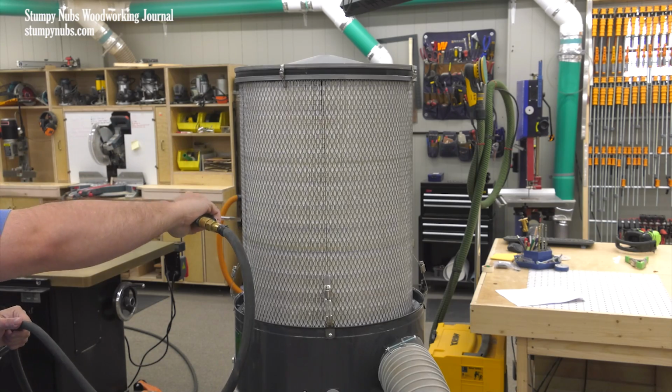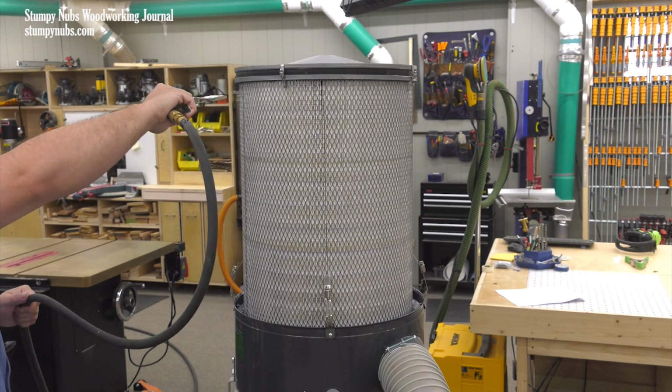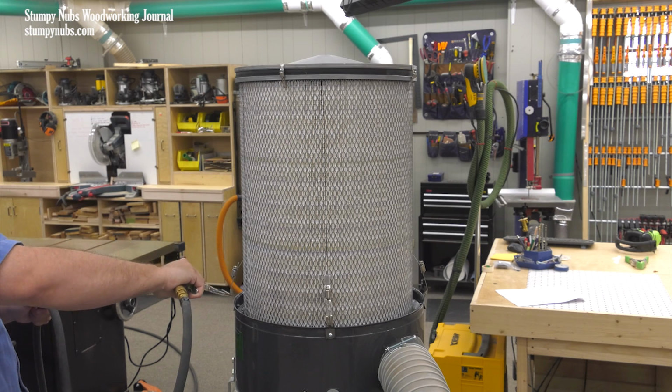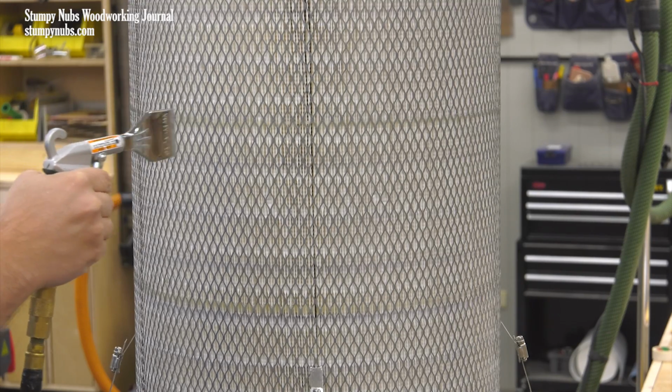If you don't feel like the leaf blower cleaned it well enough, you could use compressed air, but don't go overboard. Turn it down to about 60 to 80 psi and hold the nozzle a few inches away. This is especially true if you have an ultrafine nano filter, which features a secondary inner layer of fibers that you don't want to delaminate from the pleats.